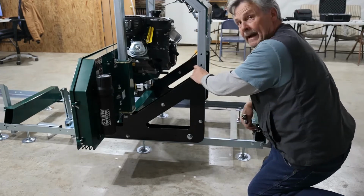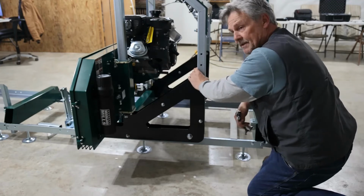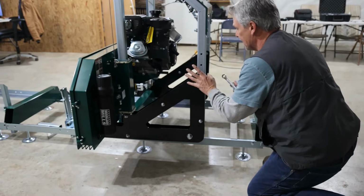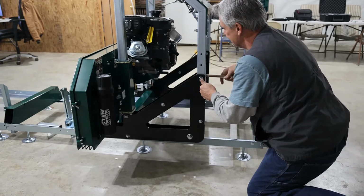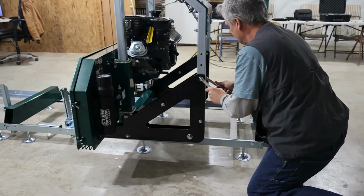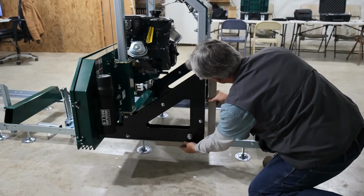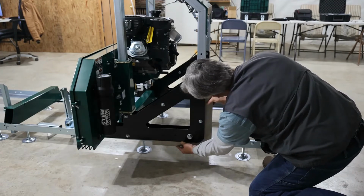Now, what this would affect on our saw is it's either going to nose the blade down or forward. This is not something they actually mention to do in the manual, because honestly this thing went together really well. So they have a really close tolerance here. But I just wanted to double check before I get everything tightened up and make sure that it's square. And it definitely can't hurt. Okay, double check that now. Yep, we're dead on it. Good.